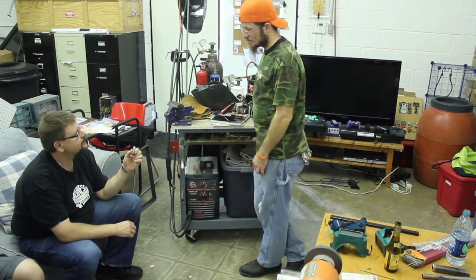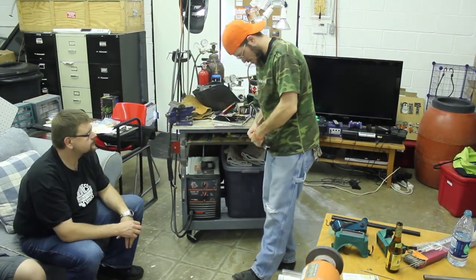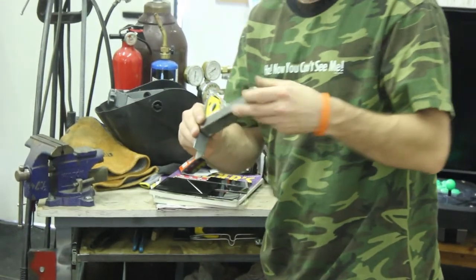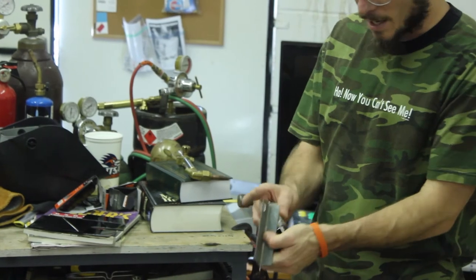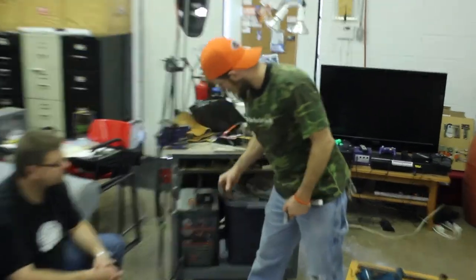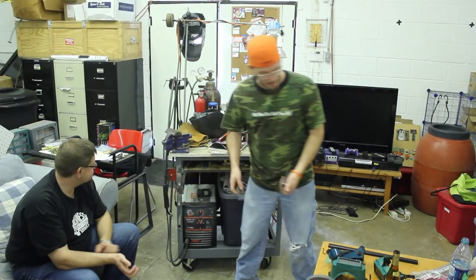So this will hold the material? Yeah, it'll hold, so I'll use it for something like holding this square over that. And, oh, cool. You know, while I weld it to a perfect square. And of course, I'm tapping it, I'm measuring it, I'm being real careful about it, but it holds it just long enough. This I like because it's not that strong of a magnet, so I can still tap it and move it. Whereas these are a lot stronger, those are insane. Those are annoying to use, that's why I use them for welding tools. You try to put those on your work and you're just fighting a magnet when you're welding.